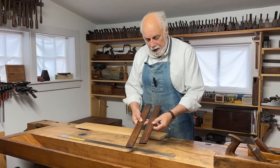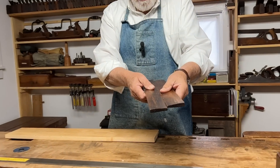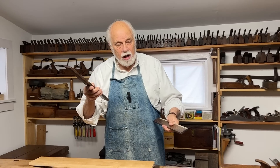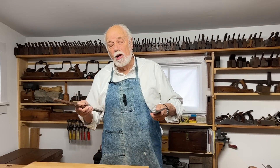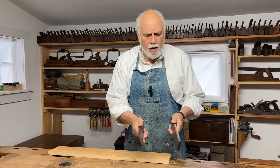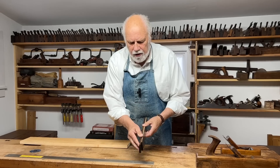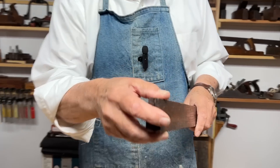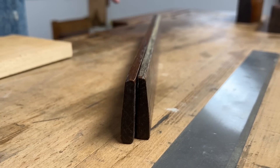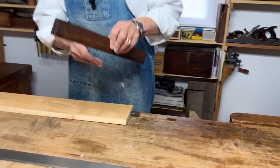This pair here are made out of oak and they're nice and straight — perfectly flat here and perfectly flat here. One is called the gaffer; that's the stick that's in charge. The other one, which tells you whether or not your wood is flat, very often has a white line or something painted along the top. Another very typical characteristic of old winding sticks is that they tend to taper from the top. They can be this length, shorter, or wider — whatever — but the key is that they must both be perfectly flat.